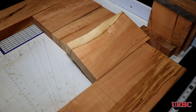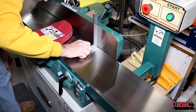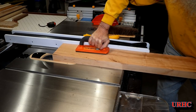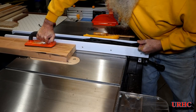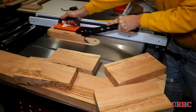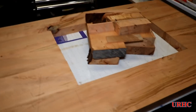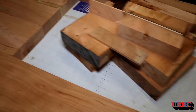There they are, all the pieces set together. You can see each one has to have the bad spots trimmed out for final sizing, but I did come out with just enough. Before doing the final cuts, I go back and true everything up — that little square I got from Amazon has been really great for that. Once everything's cutting perfectly square, it's time to start ripping things down to size. Now it comes to sizing these blocks to take out any little cracks or defects I don't want in the final top. I got my top and some firewood out of those planks — worked out perfect.